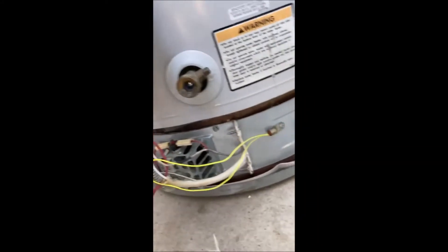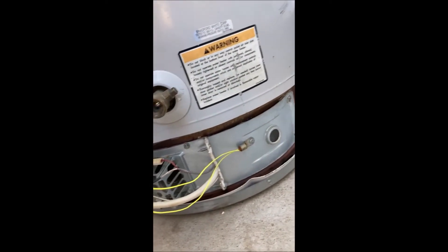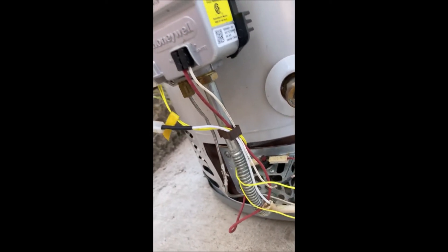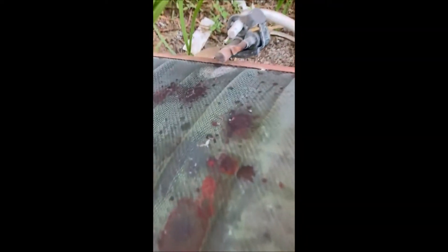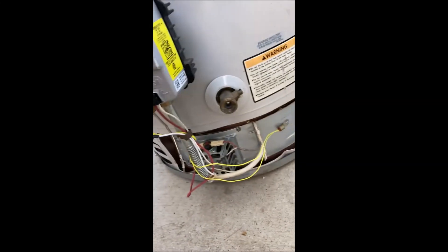There is pretty much no water heater you cannot fix with compressed air and a bench grinder with a wire wheel on it. The new burner assembly is in, pumping away, status light shows normal operation, no rip in the screen. I'm going to let this run 15 to 20 minutes. If it explodes like it did before I'd be shocked — it's got to be that rip in the screen. She's still going after about 15 minutes. Before, it would explode about a minute and a half to two minutes in. That's what the problem was for sure. Thanks for watching.